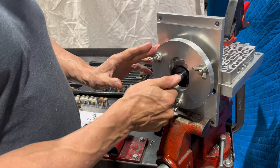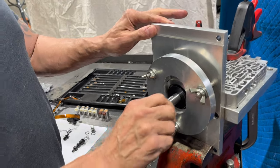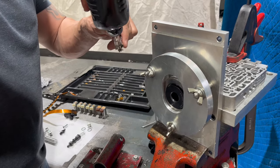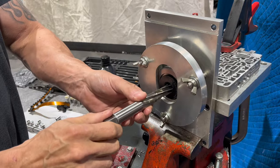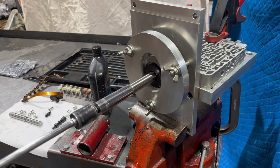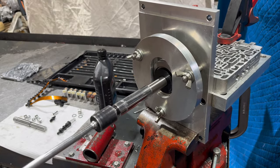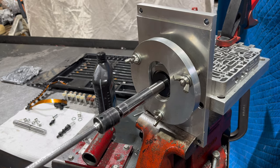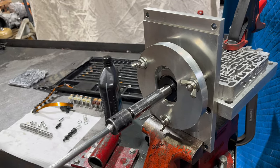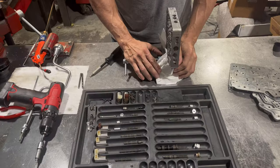Now we have this set up again to do the pressure regulator. You want to tighten this whole spherical bushing down, and you want these to be loose — that's going to tell you you're lined up properly with this tool. This tool is going to guide the reamer. You can't very well pilot a reamer off a worn bore. This is the same procedure. When you think you're done, you're usually not — got to keep going. When it starts turning free like that, that tells you you're all the way in.